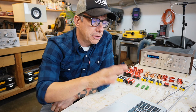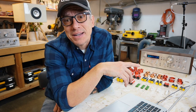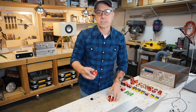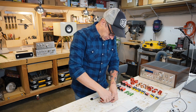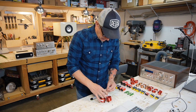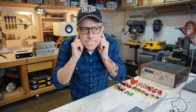We have our starting setups here. So let's go to the measurements again. All right, let's start connecting our filters and testing them, okay? So we're gonna first start with our notch, our baffle correction. We're gonna try the 6 millihenries and 15 ohm resistor. Okay, and then we try it.